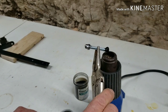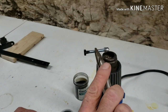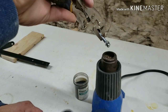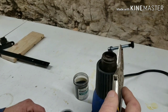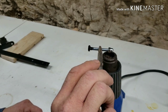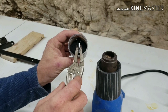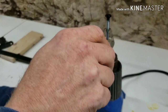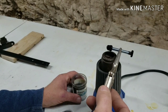If it is too hot, the powder will stick and actually start to gum up and create a stringy effect when you pull it back out of your powder. Then you just throw it back into the heat for a little while to bake that finish and let it cool off. You can see here the nut was actually a little too hot and when I pulled it out of the powder paint it created a little string. You can remedy this by throwing it back in the heat, allowing the powder to warm up and flow to create a smoother finish.